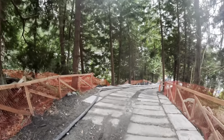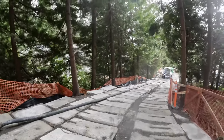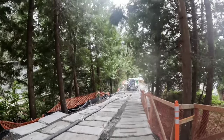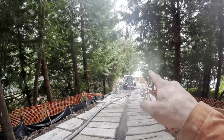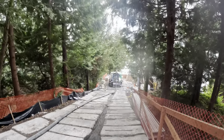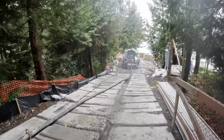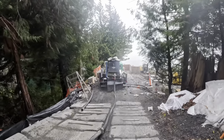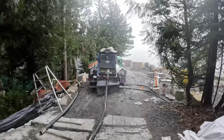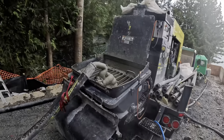This time of year. So we got the VS70, a bunch of 3-inch line, feeding into the little TK60. This allows us to keep it drier and pump it faster. We have pumped with the same setup with the TK60 from up top, but we were limited to about a load every hour, and we had to keep it a little bit wet or we were bouncing off the relief valve. So you're gonna see here, even with the 60 down here and the amount of line cut in half, he's got about 200 feet of 2-inch line. He's gonna be damn near pegged on the pressure gauge. 4,000 is pegged on this thing.